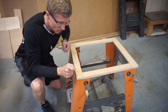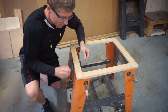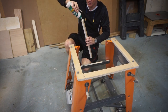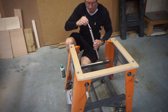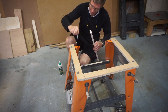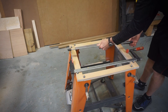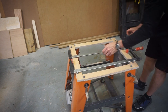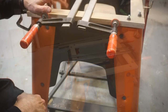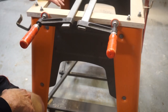I'll temporarily install the carriage bolts to hold the pieces in place, and then I will glue them and pin them just so that they're a little bit more solid. I'll apply some glue to the ends and put a little bit of light clamping pressure on it to tighten it up. Now, while this is gluing up, we'll go ahead and cut the remaining pieces that will form the walls of the dust collection carcass, or the box.